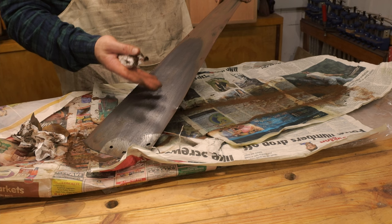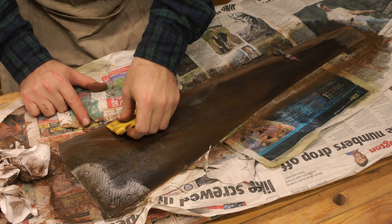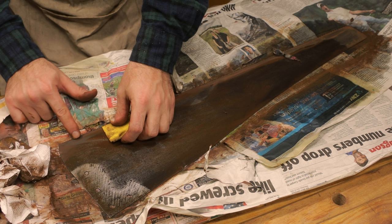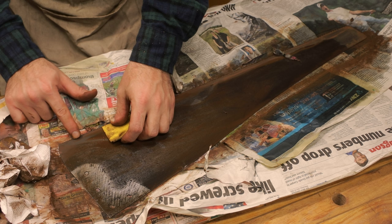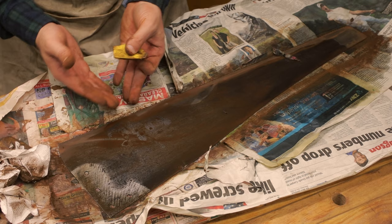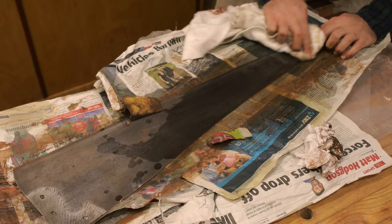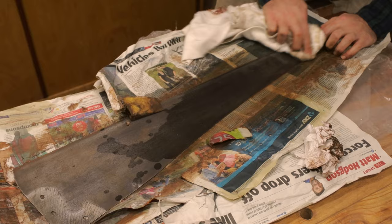There's still some brown around the edges here and we definitely want to remove all of that. I'm coming right up to the edge here and just avoiding the teeth. When I come in with the 240 grit, I'll just rub the edge of these teeth a little bit. In the use of the saw, that rust doesn't really affect the cutting edge — once you start putting it through the timber it tends to take that rust off anyway. I've been right across this and I've removed the rust over pretty much all of it now, so I'm just going to wipe it back to make sure I haven't missed any. We can see that the rust dust is all gone now.